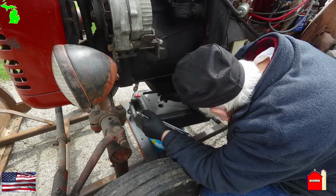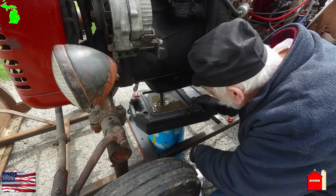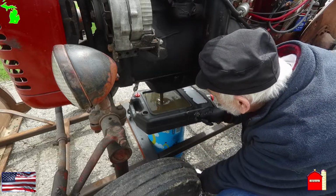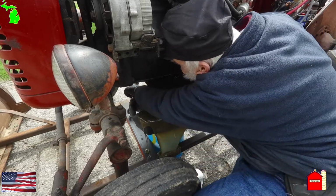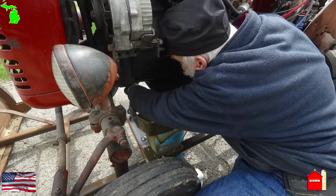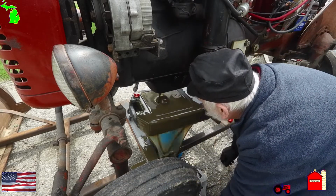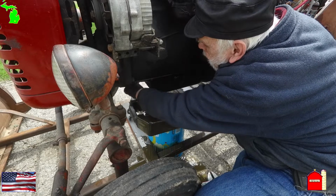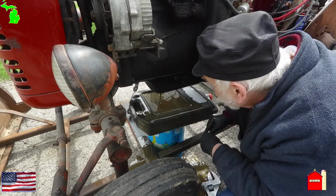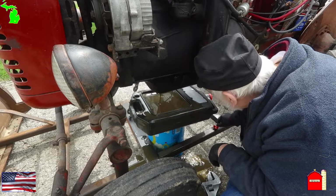I needed a gasket that has an outside diameter of just under 4 inches. I wanted the gasket to be a 1/4 inch or so wide. I wanted enough wiggle room or slop to fit everything together and seal against any oil leaks. For those who are interested, the gasket needed to be only 1/8 of an inch thick. For those who are not interested, the gasket still could be as thin as 1/8 of an inch.